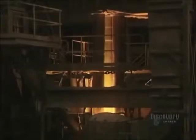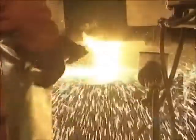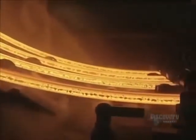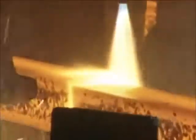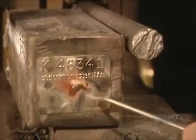The electrodes are taken out of the furnace ladle. A workman now opens the pouring nozzles of the distributor, equipped with four pouring holes. The molten steel runs into molds and very quickly cools and begins to harden. Steel billets are produced in lengths varying between 4.5 meters and 10.6 meters. The billets are then cut to the desired length with a natural gas torch. A pouring identification number is marked on them with a wax crayon.